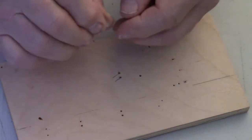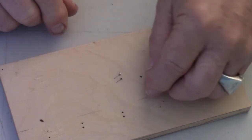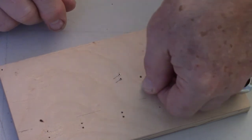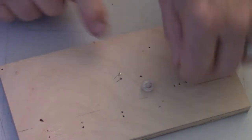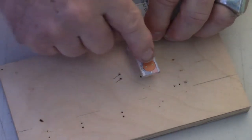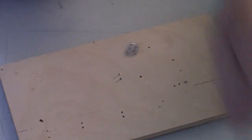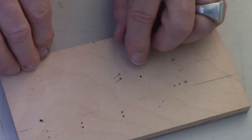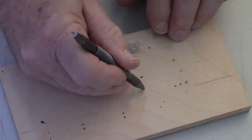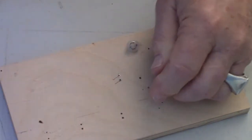If you want to put the ceiling canopy piece in, it works basically the same way, but we don't need to have the micro jacks. I'm just going to place this in the ceiling, push it down enough to give me the pin marks that are on there, or use the gauge so that we can put the marks exactly where we want them. We can orientate this so we're perpendicular to the run that we want to have on the thing. Once we have those marked, again, I'm going to use Bam Bam with the center punch so I can make the indentation so the drill finds it.